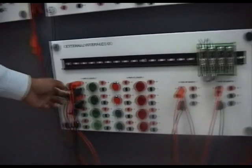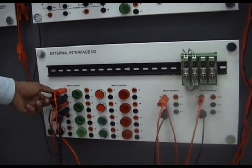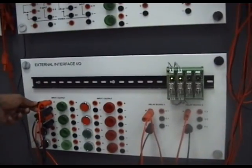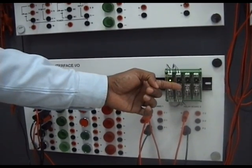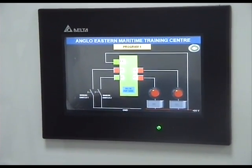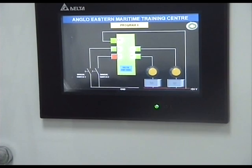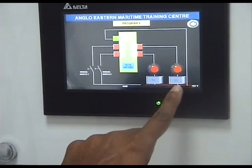I have already made the connections — X0 and X1 are the inputs; the outputs Y0 and Y1 are connected to two relays here. I start X1 and X0 — both relays come on and will remain on as long as the condition is stable. Now I put off one of the inputs and the countdown begins. At the end of 5 seconds one relay goes off, and at the end of 8 seconds the second one goes off.